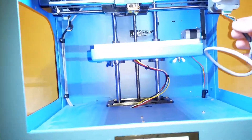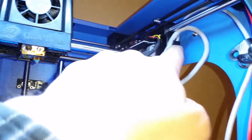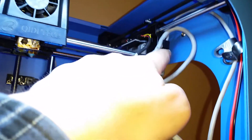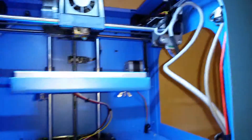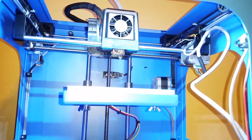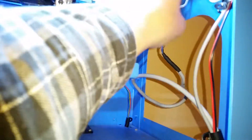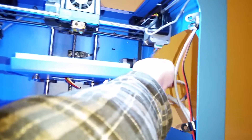What I'm going to try is wiggling around the x-axis cable — they look almost a little kinked in how they're sitting inside the case. Moving the cable back up into its little tab holder on the carriage for the x-axis, the way it's holding the cable there's a kink in it. Now when I press X it gets the little jitters — it doesn't know which way to go. So let's pull this cable back down into a relaxed position and try again.